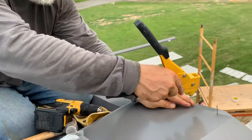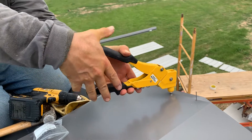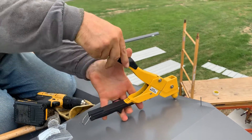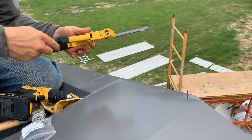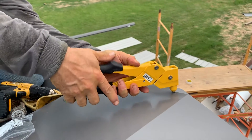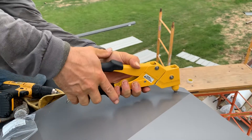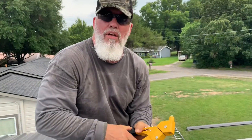Unlock, and I'll place it onto the stem, and then you just ratchet. You do it a couple of times, and it swells out the head. It pops off. There's that one, and here is the other one. That's really all there is to putting in a rivet.